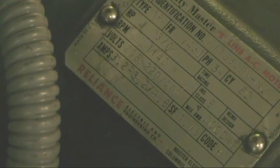But there is a way that we can get greater speed out of the induction motor. Now we're back onto the induction motor, and you can see again the nameplate. It is rated for 220 and 440, or basically 240 and 480. And on 220 it says 3.2 amps. So basically for the same frequency we're getting twice the current. So immediately that says we're getting less of that back voltage, so the current isn't impeded as much.